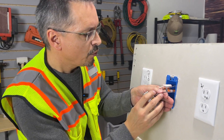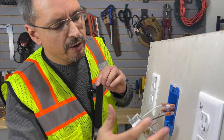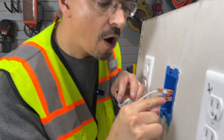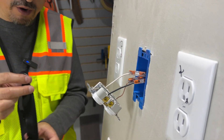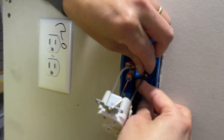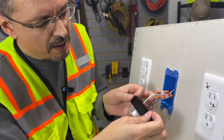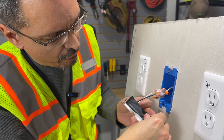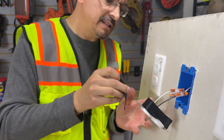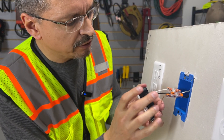We're ready to gently fold the wires back in. Bonus tip: a viewer once told me that when shoving the WAGO connectors back into a full, crowded box, the levers caught on something and flipped up, loosening the connection. If you're concerned about that, you can take electrical tape and wrap it around your connector so they're super tight. In addition, some professionals teach to wrap the terminals of the outlet with electrical tape. A roll of electrical tape is 99 cents — very inexpensive. By wrapping those exposed terminals, there's no exposed metal, so nothing can short out.